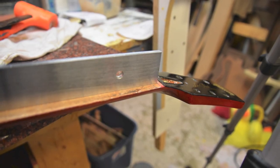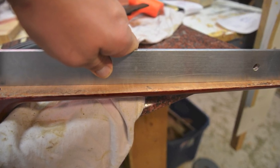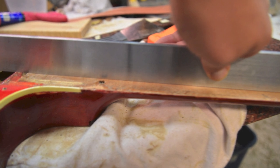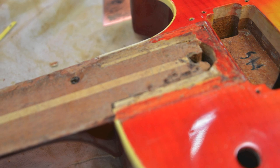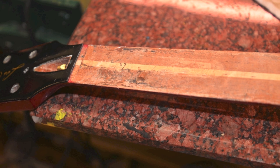Next, I wanted to check the neck and see if it's actually straight or twisted. I've got my long 36-inch Grizzly straight edge, and the neck actually seems to be in pretty good shape. So the fretboard was glued on improperly and it was causing a bunch of issues. You can see all the hide glue that was left on here, so it definitely requires a lot of scraping.